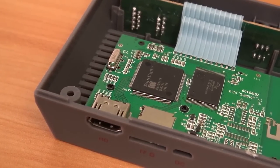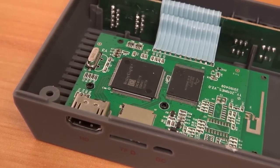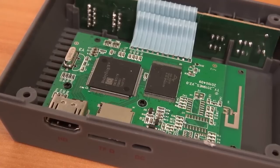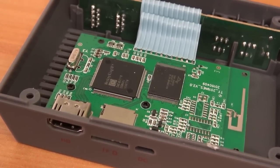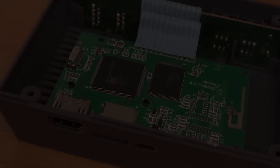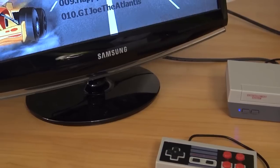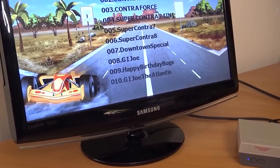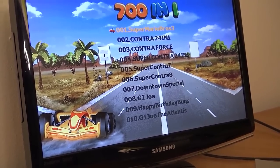Thanks to members of the Wicked family, I got more information about this Monkey King 3.6 processor. It is actually a rebranded Rockchip RK3036. It has a dual-core Cortex-A7 processor with a Mali 400 MP GPU, and this system is running on Android 4.4. So people, we're going to get Android. Like the Sega version, this thing runs with the same specifications on the main board. With previous models they used a multi-game card inside a tiny casing, but now we get something more like an Android look-alike menu.